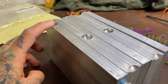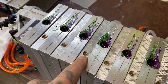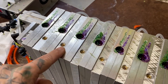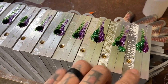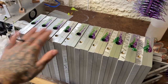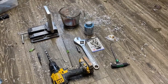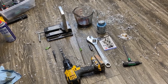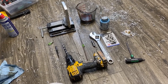One thing I will tell you is I went with quarter-inch NPT, and I would honestly suggest going with something smaller. Something to keep in mind: the larger the bore diameter, the more it may affect the plates' ability to cool efficiently. But even with this channel, they cool magnificently. These molds will stay at 67 to 72 degrees the whole time, even after I shoot a gallon — I just keep the reservoir filled with ice water. This is an extremely simple process; don't overcomplicate it. I screwed up one plate but I'm going to show you tips and tricks to prevent that. I've done three of these now and feel like I've learned enough to show you how to do it yourself.